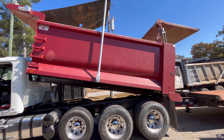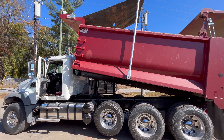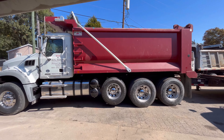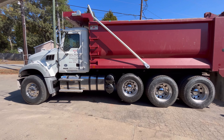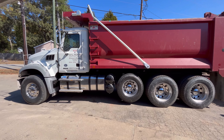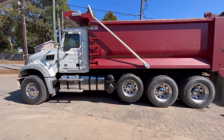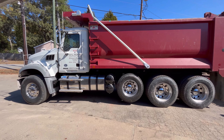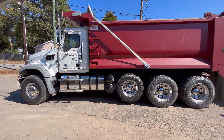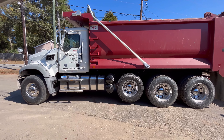There's the tarp — that's what I mean by an asphalt tarp. As you can see, it's solid, which helps keep the heat in so your asphalt doesn't get too cold. I'm not a fan of those kinds of tarps since I don't haul asphalt much. I prefer the mesh tarp because wind can get underneath a solid tarp and it starts flapping. You could put straps but that's just more of a headache when we don't need it.